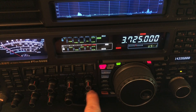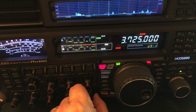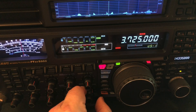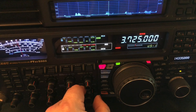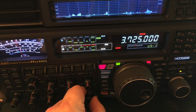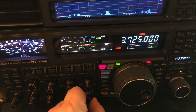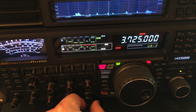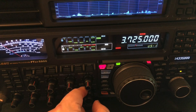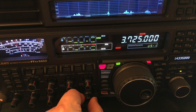So now I'm going to go to this ring around my volume knob — that is RF gain. Watch the S-meter. As I'm rotating counterclockwise, the RF gain will bring the S-meter up. Think of it almost like a squelch. That's why on some radios the RF gain can also be a squelch — it's a menu-selectable option. On the ICOM 7300, if you turn it to the right it is a squelch; if you turn it to the left it is RF gain. What I'm doing with the RF gain is lowering my receive sensitivity.